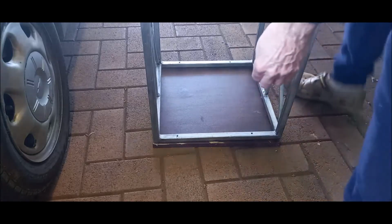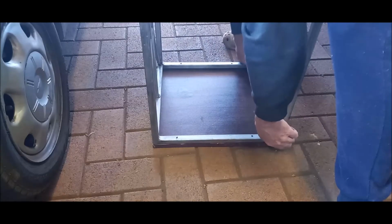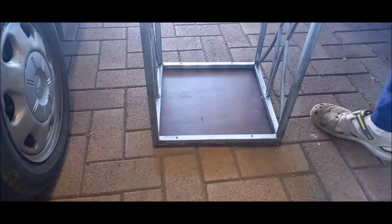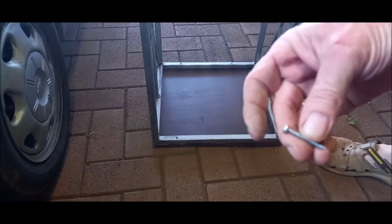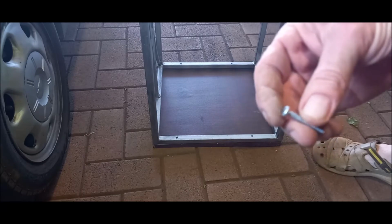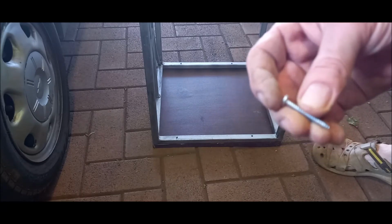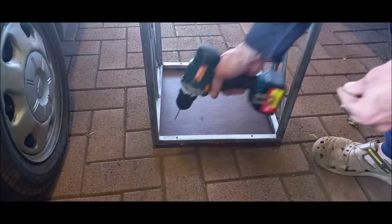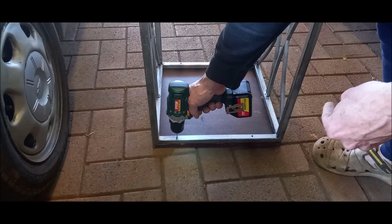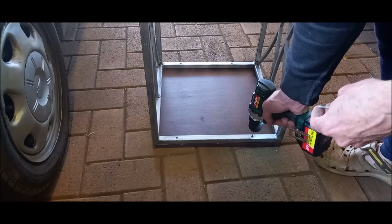First, you just line up these things here quickly, make it nice, and then, because the screws I'm gonna use is this type of screw, self-tapper. But it's not a wood screw, it's not a proper one. So I need just to drill a pilot hole for it to work better. Drill 4 pilot holes.